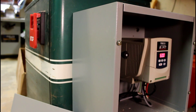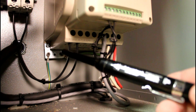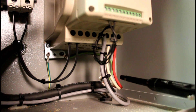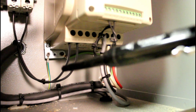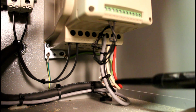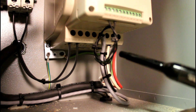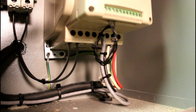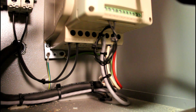Let's get into the connections and show you wire by wire how this thing actually wires up. The power comes in here as the power source, followed by the power out. These three legs — black, white, and red — are my three phases going out through the motor cable, along with an additional ground bonded to this enclosure at the same PE (protected earth) potential. The last cable is a low-voltage 18-gauge wire — just two leads twisted and cable-strapped together. When their contact closure is made the VFD goes on, and when it's broken it goes off. Really simple — you can use any maintained switch with this, based on how I've configured the programming.